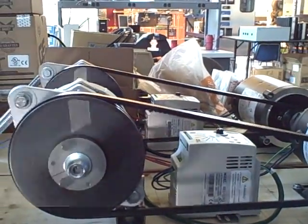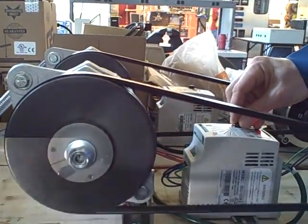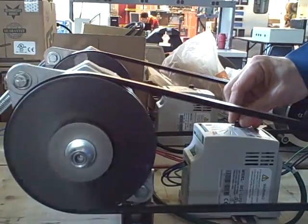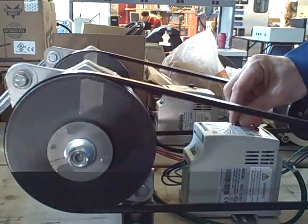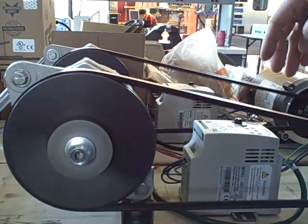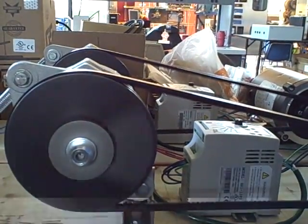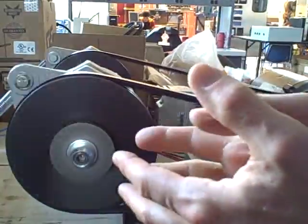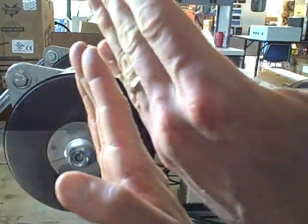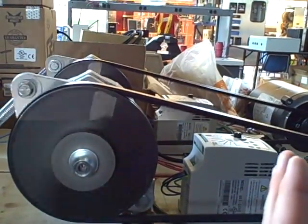Watch as I slow the frequency down on the motor here from 60 hertz down to about 59.2 hertz. What's happened now is I've tried to slow this down, and as a result, this generator is not being mechanically spun as hard as it was before. It's actually now receiving power from the other generator as a motor to try to keep up the speed. And as a result, you can see a slight splaying of the angles in the tapes — this one should look like it's further clockwise, or further behind in rotation, relative to the background generator.